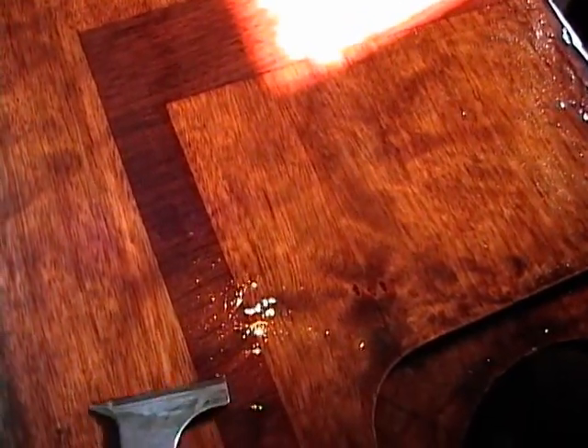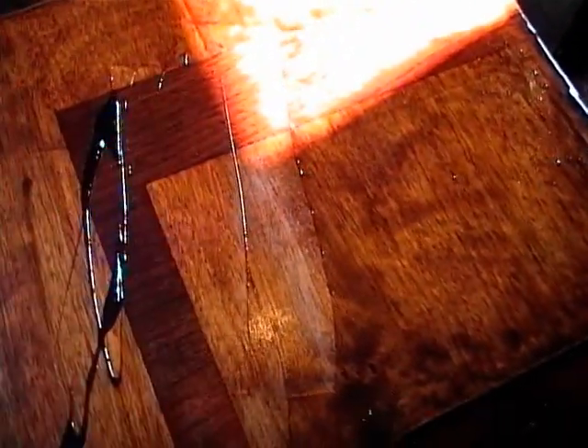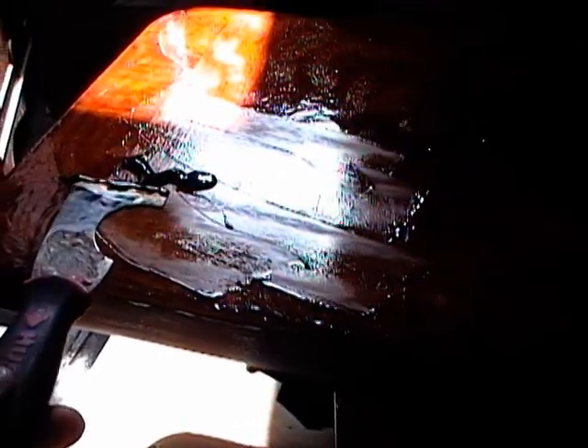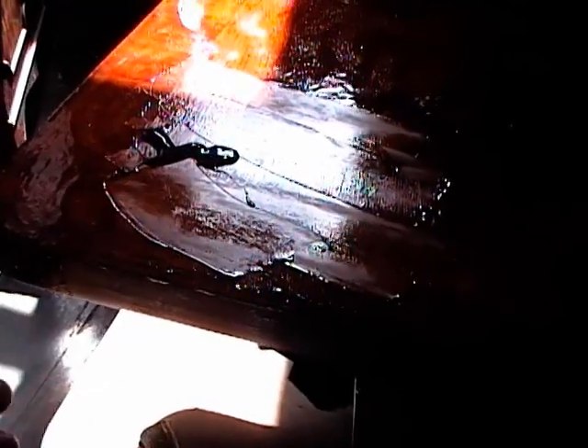Already it looks a lot better than it did. I did one pass of stripping already and now I'm ready to do another. This is going to look really, really nice. I thought that this L was a different tone than the rest, like it had actually been masked off and stained or sprayed with toning lacquer or a different color. But now the difference in color is really just in the underlying wood. Once I strip this all down, most of the radio is just clear coat or just a very light, medium walnut stain. The only areas that have a different color are around this edge and around the very bottom. So most of the work is just going to be stripping this down and then grain filler and then spraying on some lacquer.